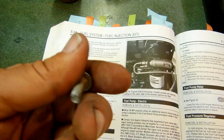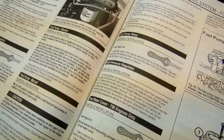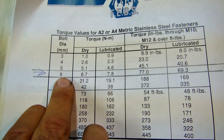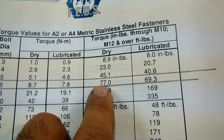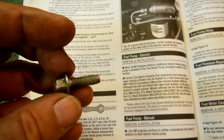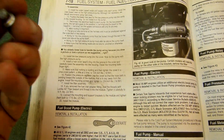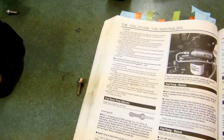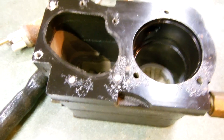If you look at the torque spec for one of these, there's no way they can take 124 inch-pounds — maybe a grade 8 steel bolt, but not a stainless M6. Any specs I found for M6 stainless are about 65 to 80 inch-pounds, and they're recommending 124 — so right there you've got a problem. These bolts wouldn't come out at all. The only way we got a couple out was using an electric impact wrench on a very gentle setting. Ones we tried with a straight wrench just snapped right off.